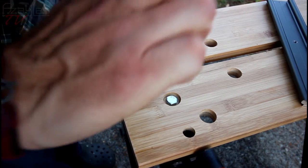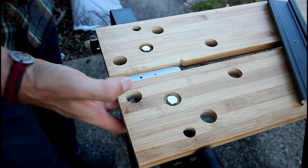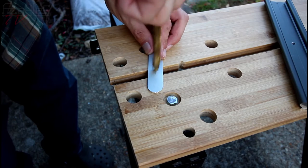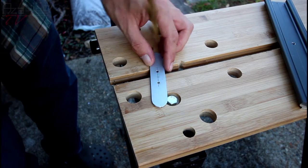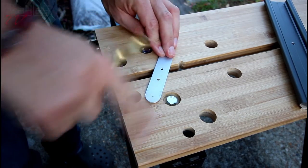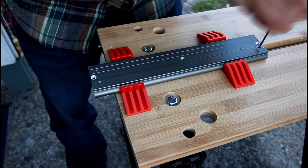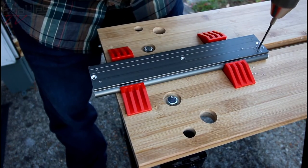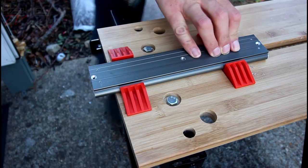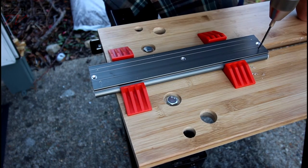This is a fairly wide drill bit, so I don't want to wobble everywhere. Here we go, look at that already. And it's quite thin stock as well. No burr on the other side. Excellent. Humongous drill bit to deburr both sides of both lots of both holes. Drill bit for an M3 tap. I guess we'll see. Pretty sure it is.